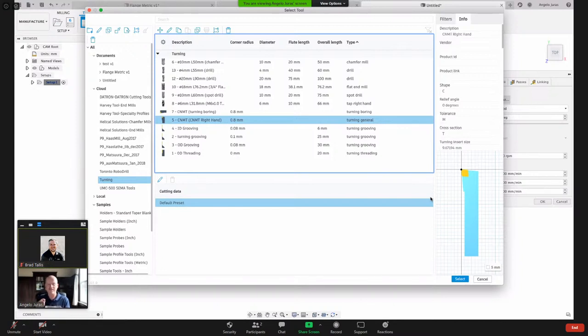So when you're on a CNC lathe, that insert is not right in front of you. That insert is rotated about Z, and now it's coming in from this direction. Still X minus going towards the center, and X positive going away. And the Z didn't change. Z positive is going away from the part this way, and then in towards the chuck. Again, I'm backwards, but you guys kind of get the idea. A few times I get people saying, hey, I need to flip my tool around because it's upside down. Don't worry about that.